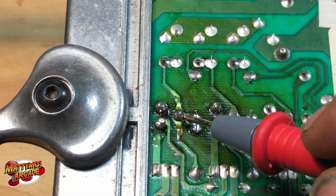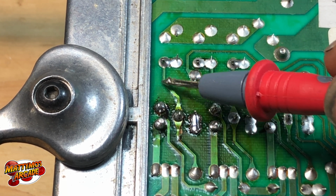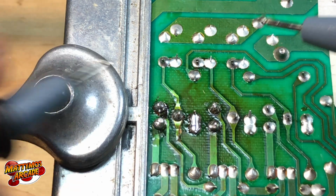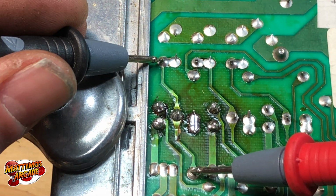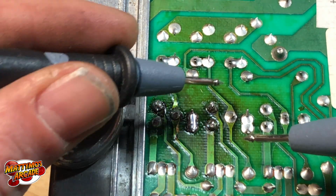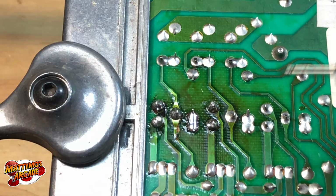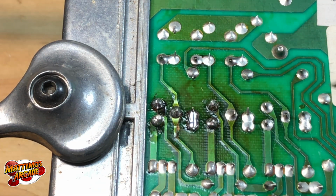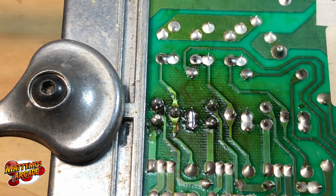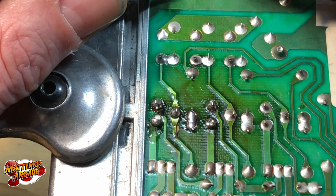You might be able to see it looks like it's a little bit rounded, and it won't matter if it's actually stuck to the board as long as there's continuous flow from there to there for the voltage or whatnot to get through. So if there's a break from here to here, then your parts won't work. It's just going to continue to check. Good there. And anybody will have this problem. Regardless of how good your skills are, there's so much heat damage in this area right here from those transistors that even with super skills, you're going to have to really pay attention to what you're doing. Because even with a good looking solder joint, it could be cracked underneath.